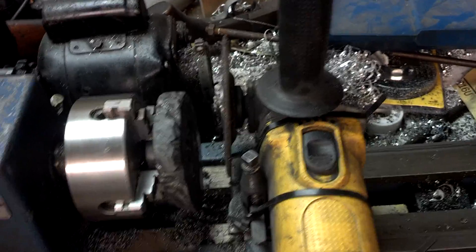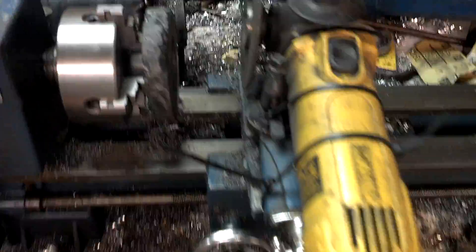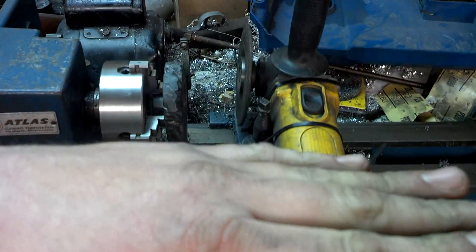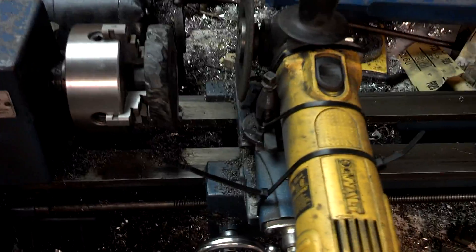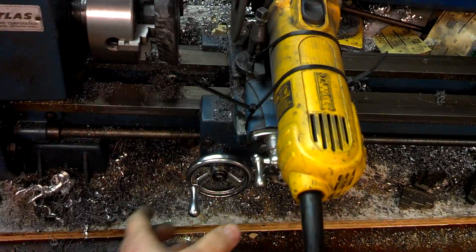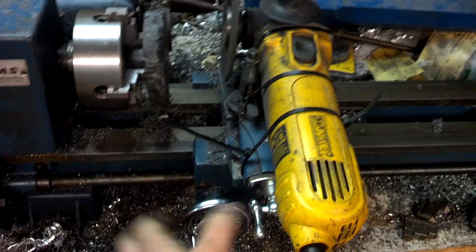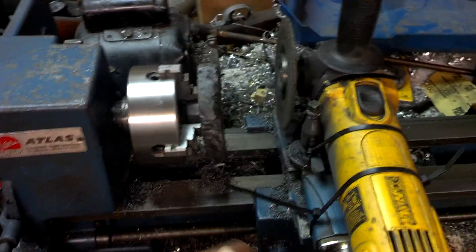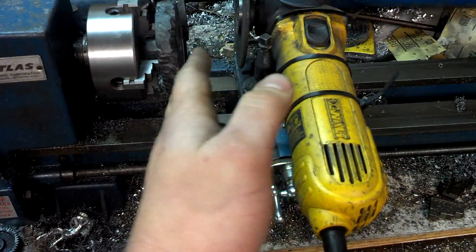It'll start grinding. And after I've started to do it a little bit, you might be able to see down here — what I've found is that gravity, because the lathe is just on my little bench here and it's tilted a little bit, and the vibrations from the motor running — the electric motor back there has some bearings going bad in it — will actually keep a slight feed into the workpiece. It's not feeding, but you can see the handle just moving slightly as it goes, so you know it's trying to work into the piece.